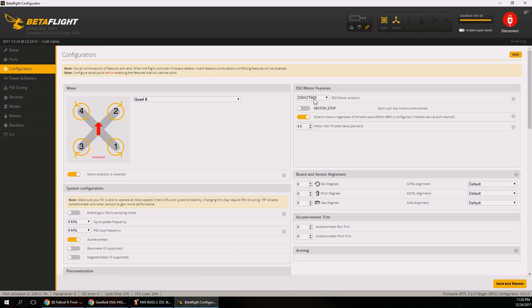If you're using DShot 600, I'd suggest trying DShot 150 and see if that fixes it, or maybe even try Multishot. Make sure it's not set to Brushed since you're not using brushed motors. I also wonder if those old ESCs were only taking a PWM signal, and maybe BL Heli S has moved on to the point where PWM input is less supported. What you have set in that protocol pulldown might be the issue you're running into.